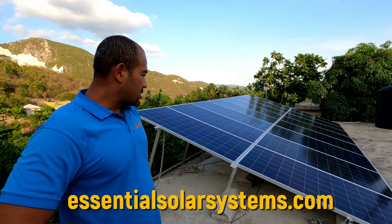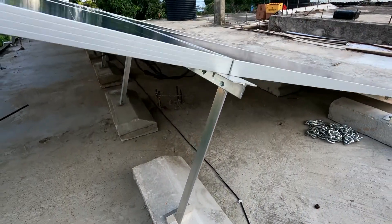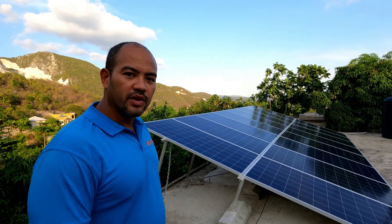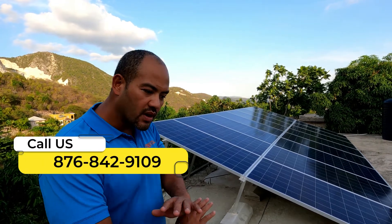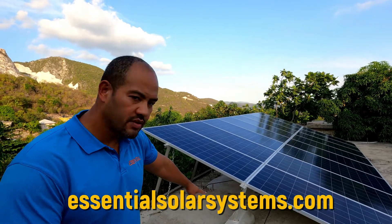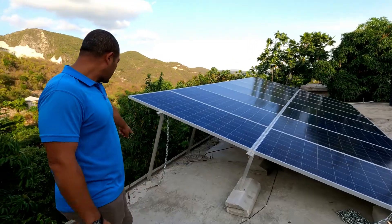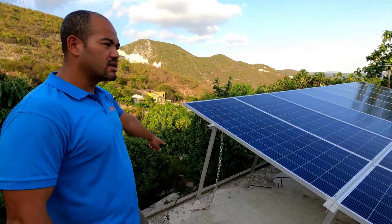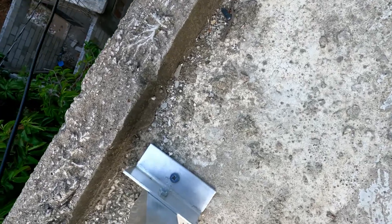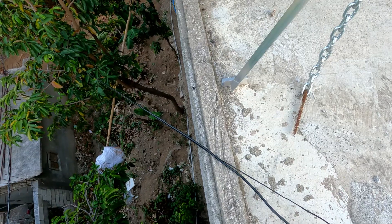So this is a good place to start. As you can see, we're on a concrete roof. We're not drilling into people's roofs - we don't really want any chance of causing leaking or anything like that. We have our blocks here. There's a little note though: we drill into this overhang - it's a cantilever. So we drill into the cantilever, which falls outside of the house.